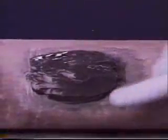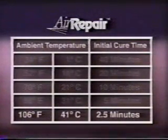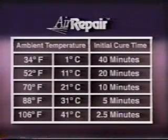It is also possible to wrap the repair with tape. Mixing and application should be done in about three minutes. Air repair sealant will harden in five to ten minutes — cure time is dependent on the air temperature. At 70 degrees Fahrenheit (21 degrees Celsius), the sealant will cure in about ten minutes. At warmer temperatures, the sealant will react quickly and may cure in less than five minutes. At temperatures closer to freezing, the sealant may take as long as 40 minutes to cure, meaning you may have to apply the sealant more quickly in warmer temperatures.